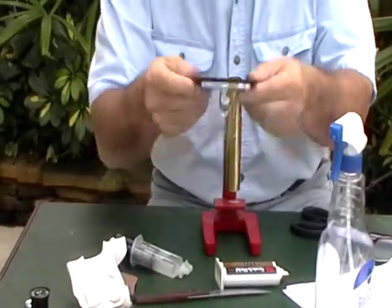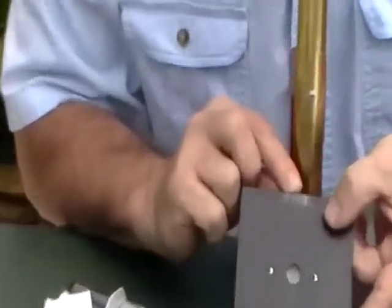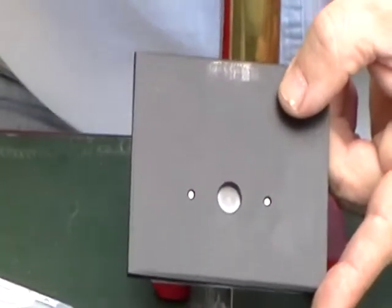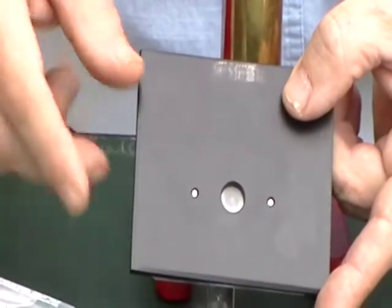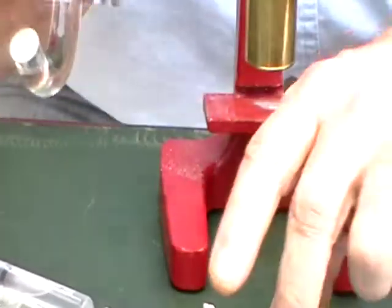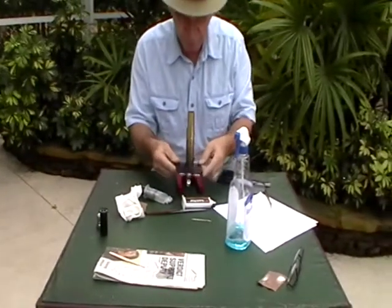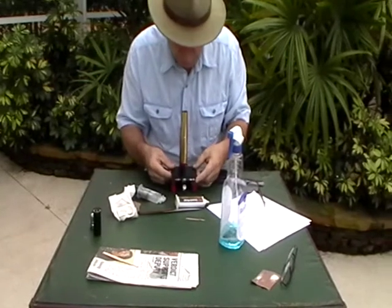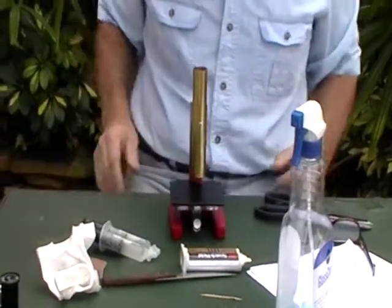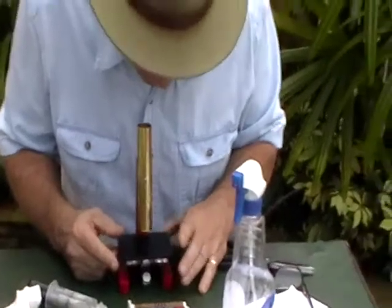Then take this — I want you to see that there is a groove here from where the stage was before. That's where you want to put it; you want to put it on even and straight, and that's what having this tube is going to help you do — see what straight is. Straight is when we go through the center of this tube and then through the light source, which you will easily see. We are going to bring that over here — hold on a second — start with it even and straight, look over it, push it back. Now let's detach the camera and I'll show you what this looks like, what I am seeing right now, which is how I align it.